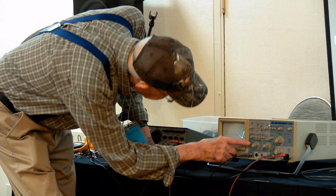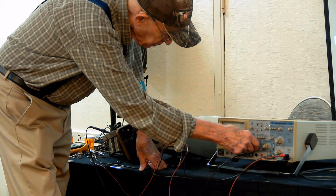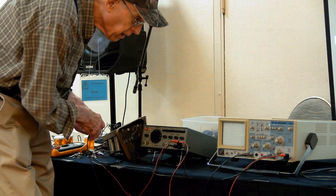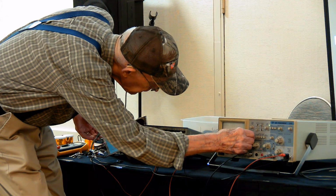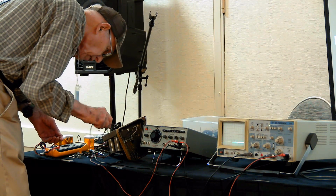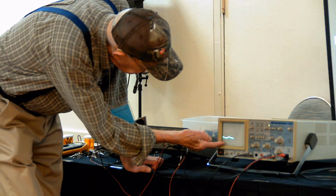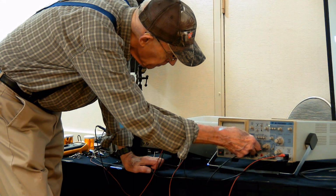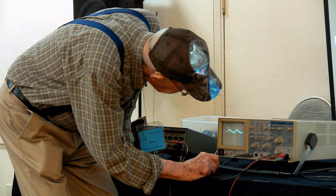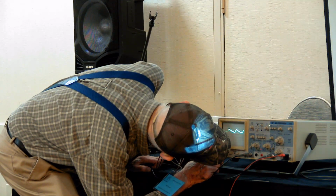One thing we can measure is either AC, just looking at the AC part of it, or the DC part. And if the DC part is being measured, then we have to set this in a convenient spot, like down here on this line. Hook this up to the plate again. And it jumped up two lines. Approximately 4.5 lines, and the voltage is reading 2 volts